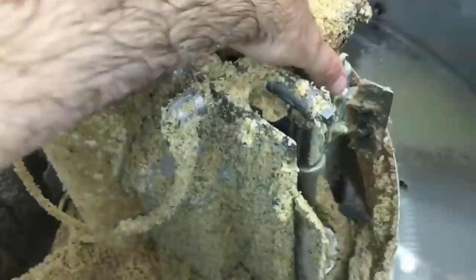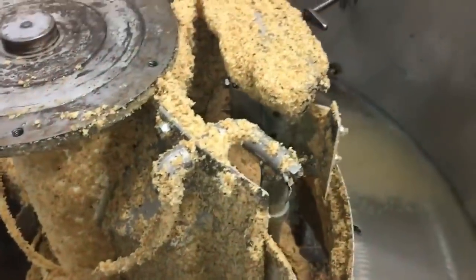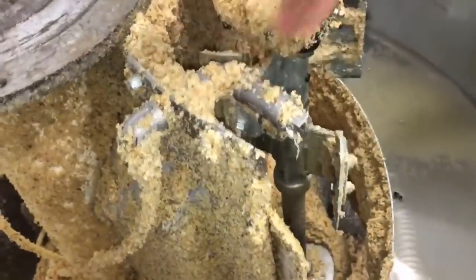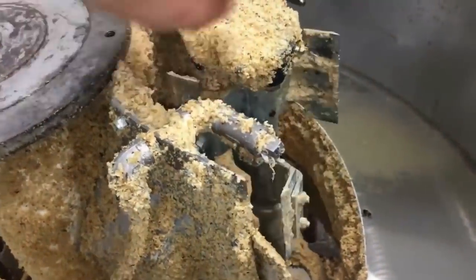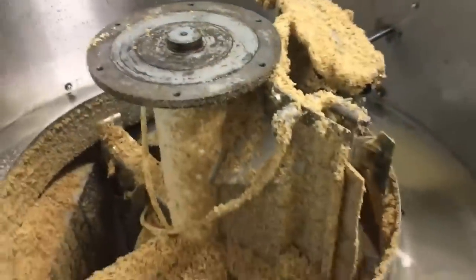But anyways, here's the water port, which cools a knife. Here's the knives here. And as this drum rotates, these knives spin. This will cut this floating layer of wax off on the inside of the spinning drum. You see, a very efficient way of handling our wax problem. Very messy way of handling our wax problem.